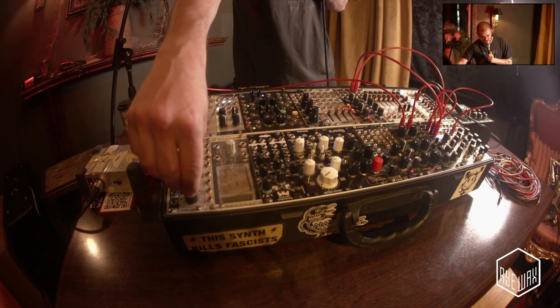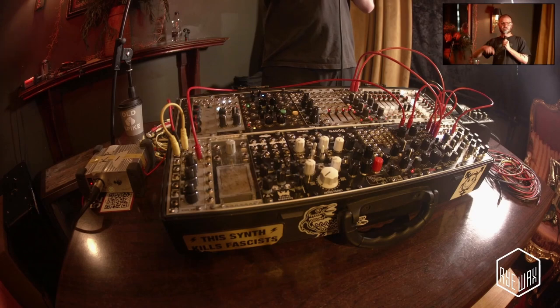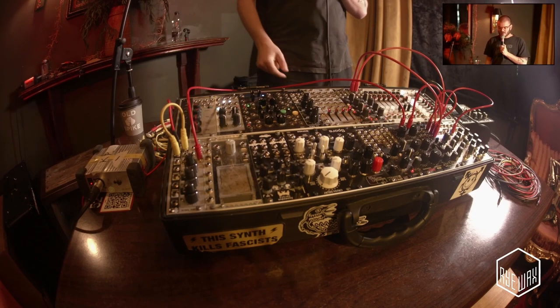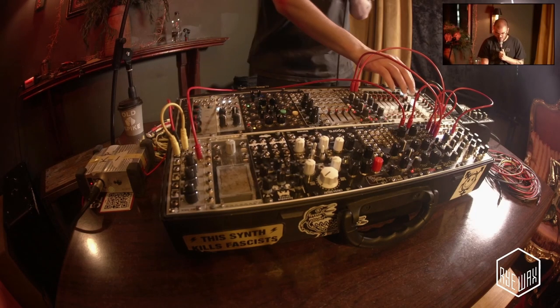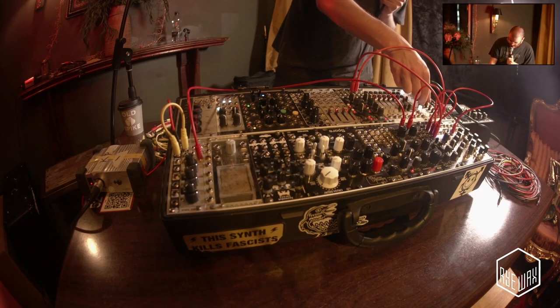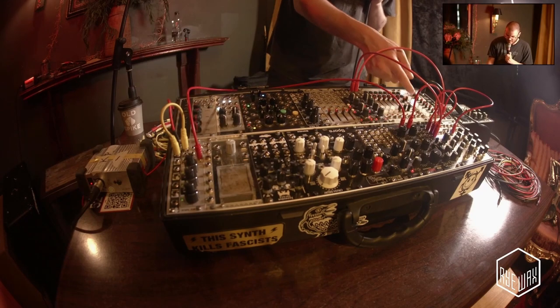But yeah, there is a scale option. Where I mentioned the volt per octave idea, effectively you're breaking down a 1 volt signal into 12 individual tones, 12 little pockets. To do the scaling, it just removes some of those pockets, so we'll automatically jump up to the next one, the same way that when you're playing on a keyboard, there's certain notes you miss. So if we stick another series of notes in here, let's speed that up a bit as well. Cool.